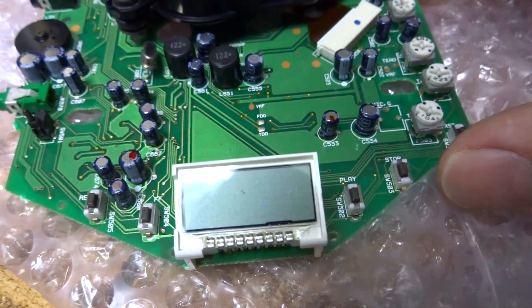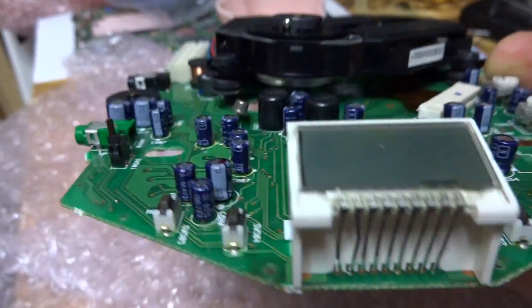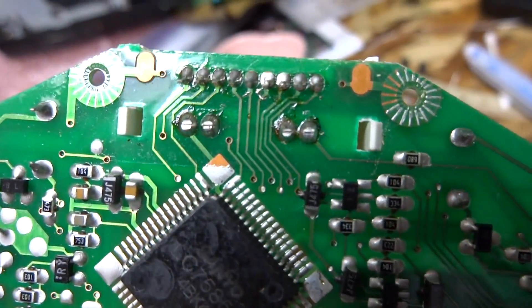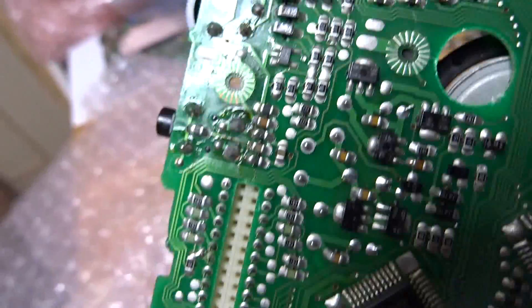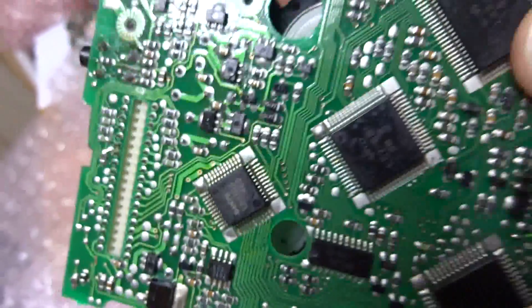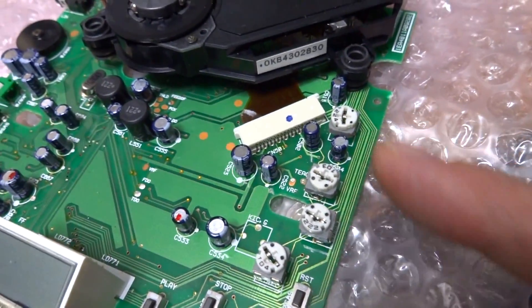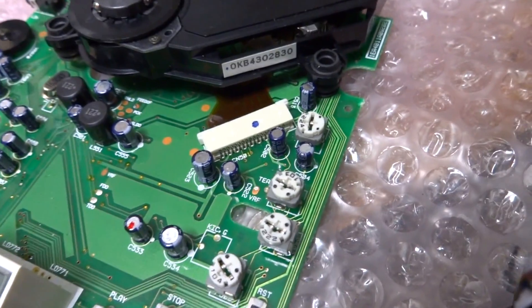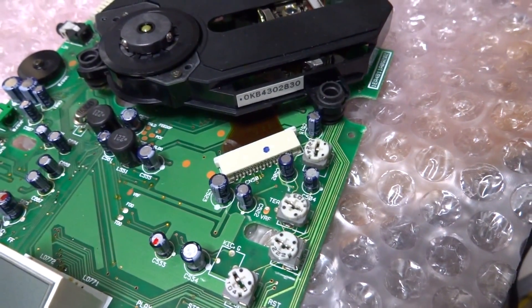Here is the main board, all taken out. You can see that somebody has been in here — there's some bent wires on the sides, and on the bottom there are a couple of traces where it looks like solder was bridged. Up at the top, somebody may have put a little bit of solder on there to try and desolder or resolder it. I'm really wondering about all of these pots here and how far out of adjustment they are — they're really difficult to get at.